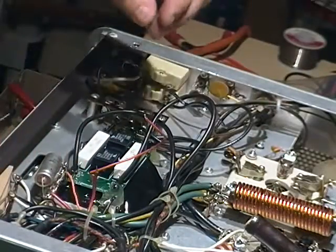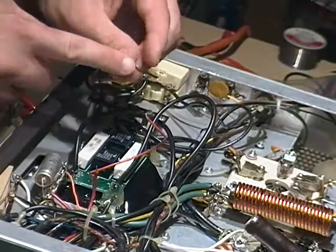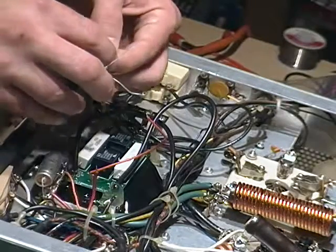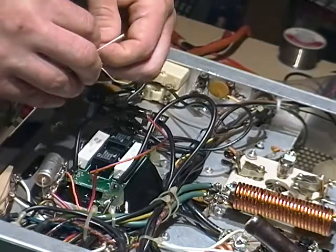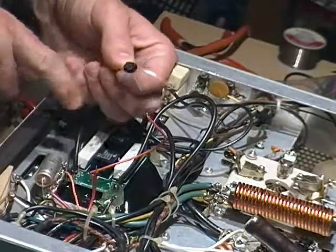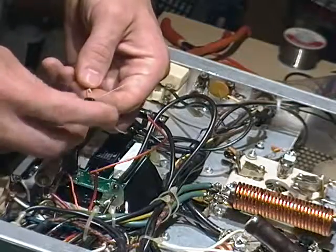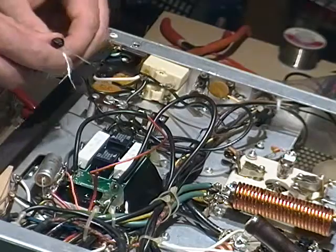What I'm going to do is make a little hook out of the wire. Here's lead E, the black wire coming off the kit board — I made a little hook on the leg, and I'll put those together. It just makes it a little easier to solder. You can trim the legs on this bridge rectifier at whatever length you want. I'm going to leave a little length though, because they have to stretch across various posts. Then one goes to the wire we cut, so I'll go ahead and solder that on.